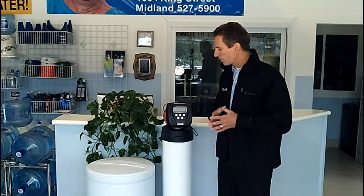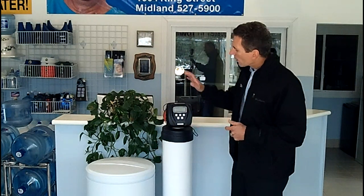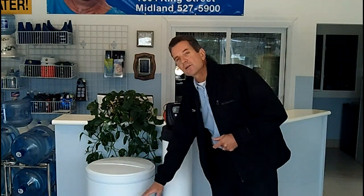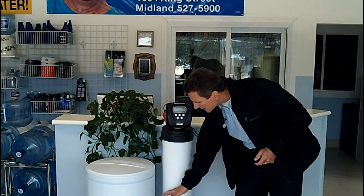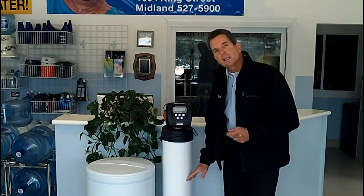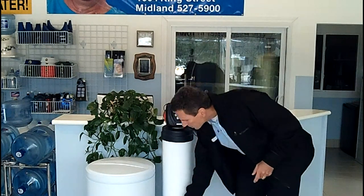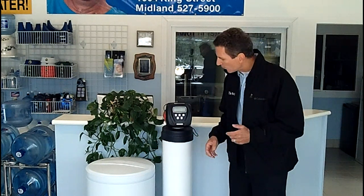So how does a tannin filter actually remove the tannins from your water? As you can see, there's two parts to a tannin filter: there's the media tank with the control valve at the top, and there's the brine tank that houses the salt and where the brine is made. Inside the media tank it's filled with a very fine media. All the water in your house or cottage passes through this media, and that's what filters out the tannins. It's through a process of mechanical filtration — physically filtering out the tannins — but it also has to do with ion exchange that removes the tannins from your water.